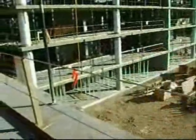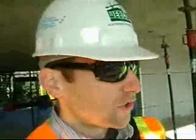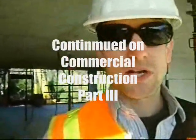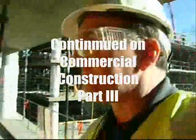Down at the first floor it looks like they're actually forming the rooms — those will actually be the apartments. They're forming up the walls of the apartments using what's called light gauge metal studs — steel studs that are rolled into a C-shape. They have some strength but not a lot. They're analogous to a 2x4 stud you'd have in your house — lighter, but durable.